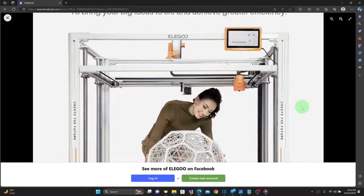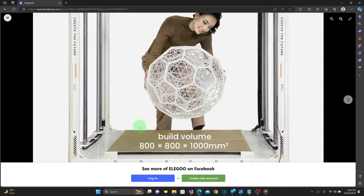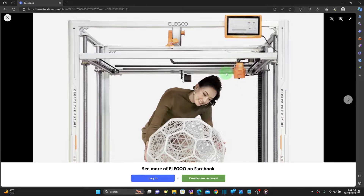Personally, I would have rather seen them go with a Core XY-style machine, kind of like a Creality K1 Max, or a machine styled like a Bambu P1P with a larger build surface. Now looking at this, it does kind of look like they're going with a Revo-style nozzle, which would be a good thing because you can get nozzle diameters of different sizes with the Revo's, and they're quick-change, so you don't have to worry about heating up the machine and removing the nozzle — you can just do cold swaps.